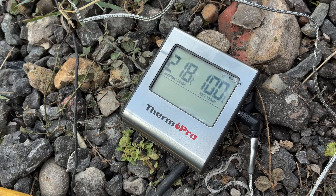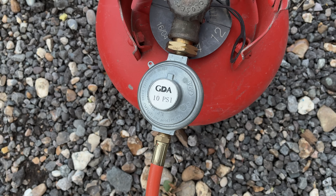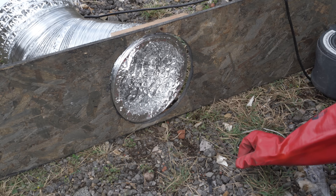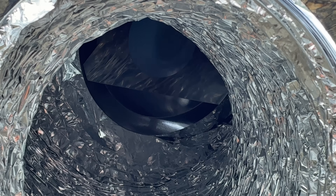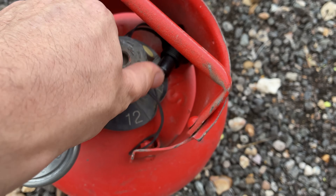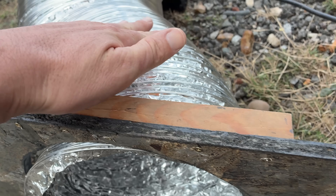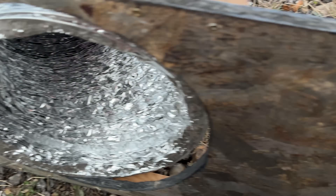The duct end, which was still mostly concertina'd short, is far too hot. The heater regulator is fixed, with no way to reduce gas flow. I did want to see how a gap made a difference, and yes, I know this is the open air where all the temperature can quickly dissipate. I settled on about a foot away and let the thermometer stabilise again — a satisfying blue hue of healthily burning propane all the way down there. We're now a little over 100 degrees, and I hope to use varying the duct length as a control for the temperature. I got a sense of whether we're in danger of singeing the OSB at the most vulnerable spot — not a hint of it. The duct cools almost instantly. I could even use fibreglass to lag a shortened duct to push the temperature further upward.